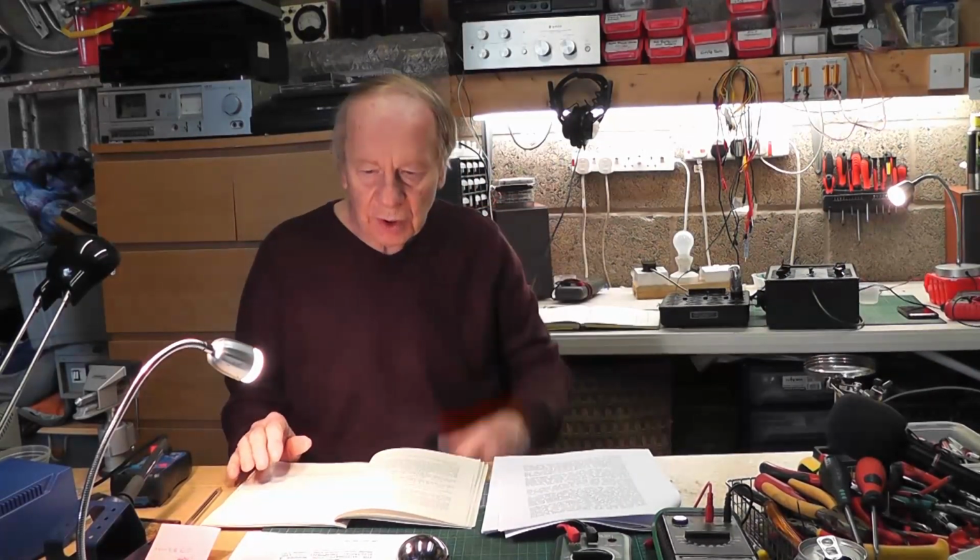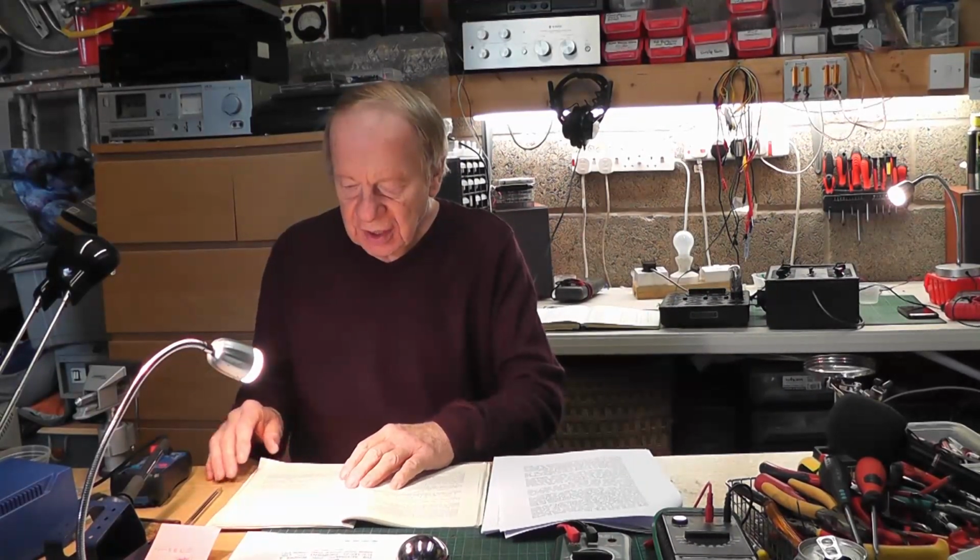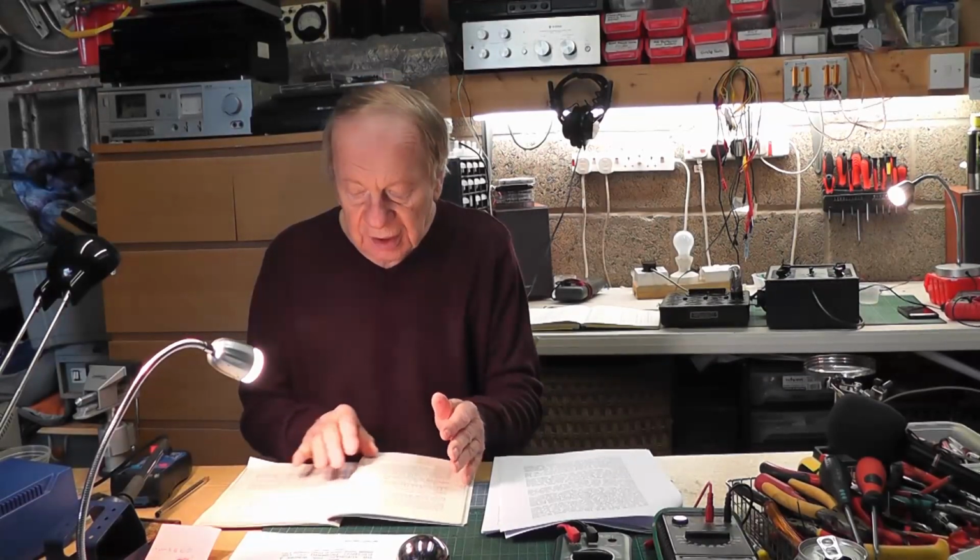Hello and welcome back to the desk. I've quite enjoyed finding out how all this works. One of the things I'd like to say about the valve tester, looking at the patents for it and the design of the thing, is that it's just totally remarkable that you can test valves using AC only. There are no active components in that. There are no DC power supplies, which would have to be very accurate, and a lot of them, to get anode voltage, grid voltages and screen voltages. But it's all done using power taps on AC transformers, with one exception: there is one diode in the thing which is used to do the grid bias voltage. But the way it's worked out is incredibly complicated. I haven't understood it completely yet.